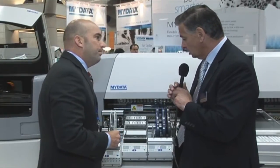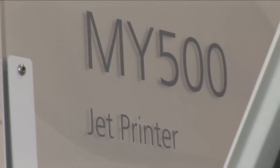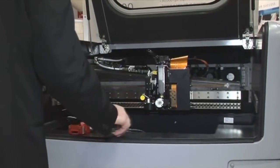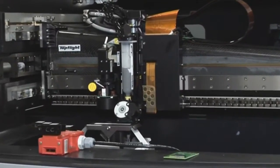One of the other things we have on the booth this week is obviously your MY500 printer. This is a printer that you brought out a few years ago, which is very unique because it's really a dispenser-type printer where you can get volumetric heights of paste. Here we are in front of the printer, Jay. One of the nice things about the MY500 is you don't need stencils, which is a time saver and a huge cost saver. This award-winning technology from MyData gives you complete control over the printing process, down to the individual pad — you can actually tell how much solder you want on there.